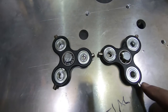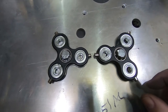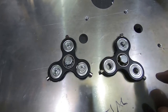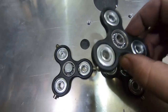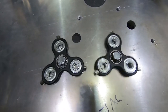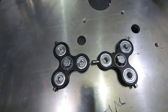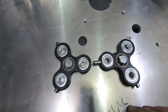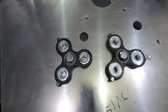Some problems though - these magnets are just too big. These are a quarter inch, and that's just a bit too wide for the plastic to be able to drill into easily. So I think I am going to order some new ones and find something in between the 3mm of the small ones and the 6-point-something mm of these larger ones. I'm also going to have to make a jig for drilling those, because that was a pain, and I was just doing a total of four spinners - I'll have to do 100 to 150 eventually.